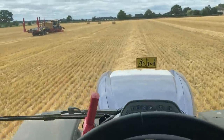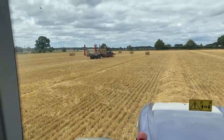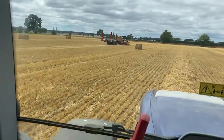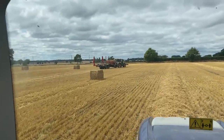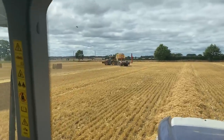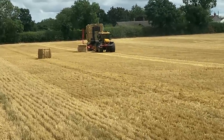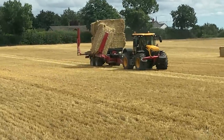I've got a nice straight row, I've got the GPS set up, got a chaser in the same field as well. I'm trying to do a bit of footage to show how it works - it's got a wheel on the front which will rotate the bale over on the side, you go in there and it automatically closes, picks it up and then drops it on. When there are two bales on there it will automatically lift it up, push it on the top to the next two, roll it over, pick it up and drop it in. You can pause it until it gets to the next bale.